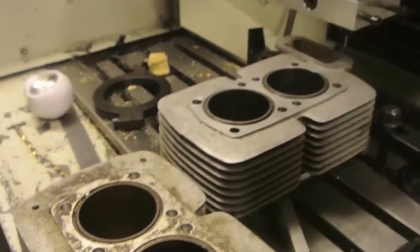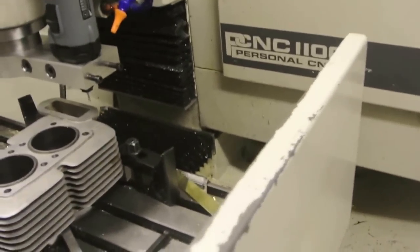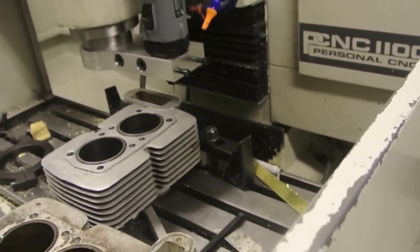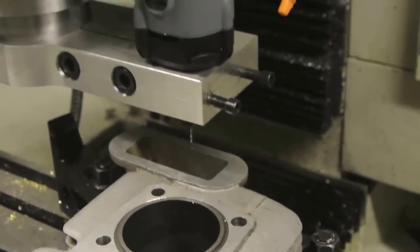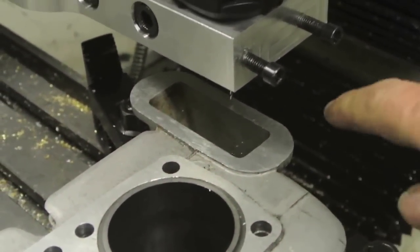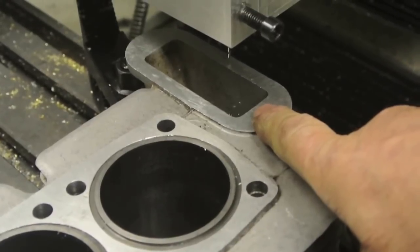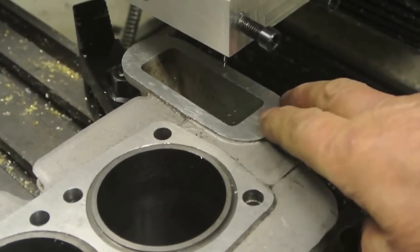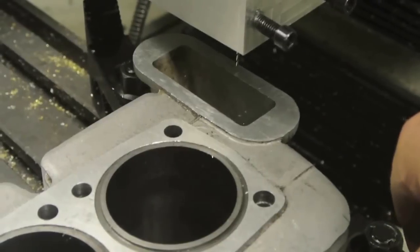There's not an awful lot of room around the edge for this thing, so I need to double check before I actually commit to cutting metal. I've checked everything and it seems to be fine spacing-wise around the flange here. It's not going to be very clear yet, but you'll be able to see it forming as I make progress. I've just got to set my Z to zero and plug in the crest.